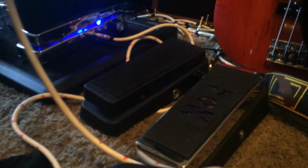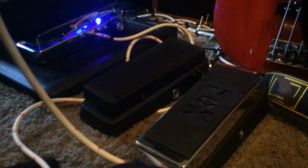So why this wah is cool, you can fatten it up. Shave a little of the highs off there and get the sweep a little lower, a little less harsh sounding. Third setting, like a lot of those custom Dunlop wahs, like the Slash, Zakk Wylde, all those, uses a 22 nanofarad cap. So this third setting's right where that's at. So here it's like that Alice in Chainsy, like that fattier type sound.